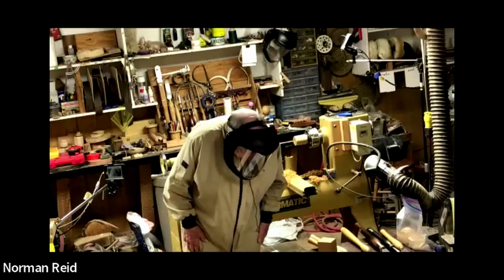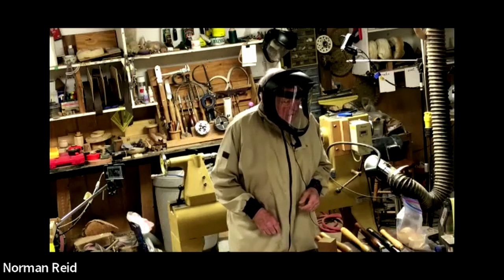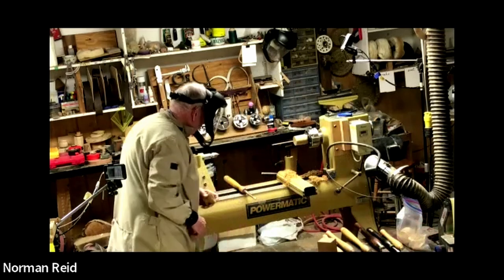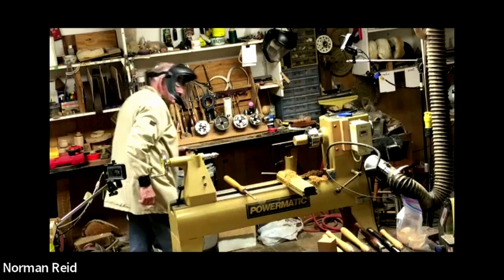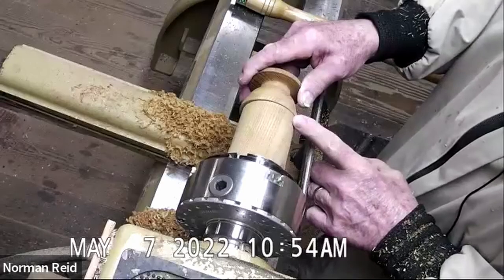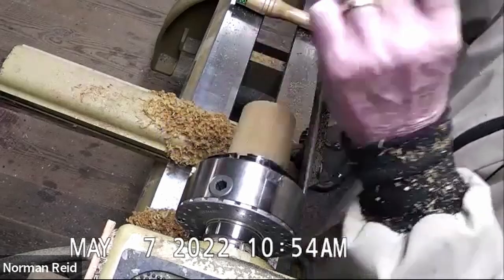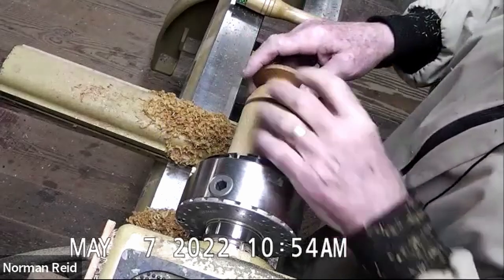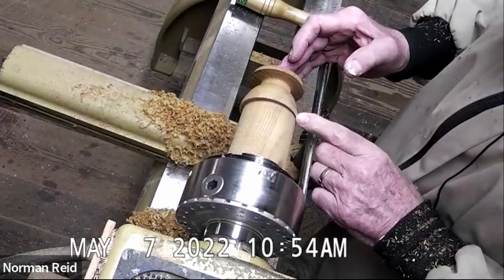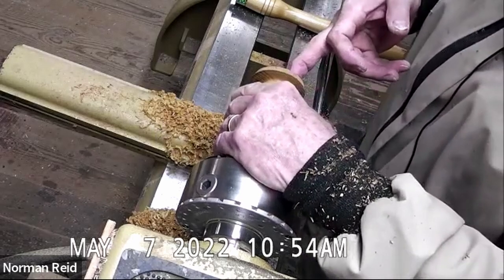So now what we want to do is figure out how. Did my piece come back yet? Now the base flange: this thing is going to fit on the base flange that's here. What we have to do is size this base flange to fit inside this bit. The first fit we do is a jam fit so that I can jam this on. Then I can detail this little bit in here so that I have a good solid fit, and I can also finish turning the top of my lid.